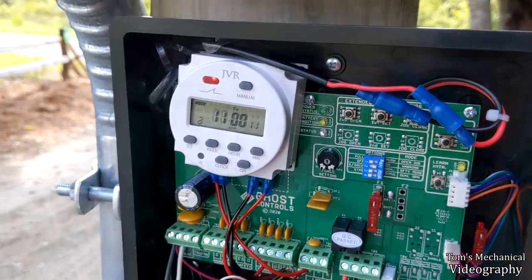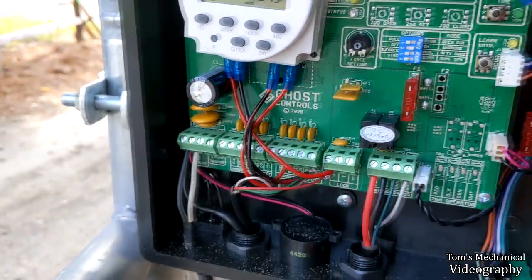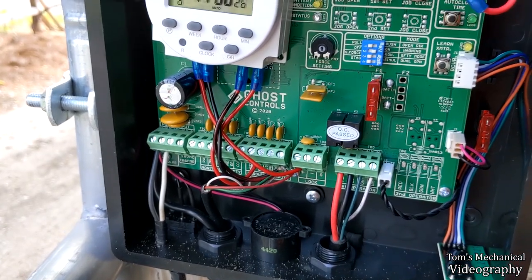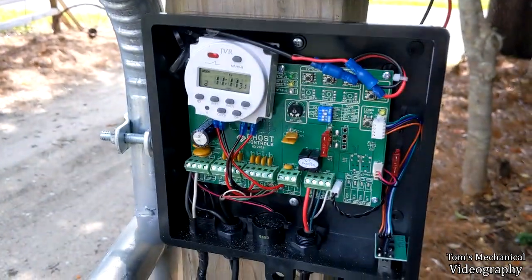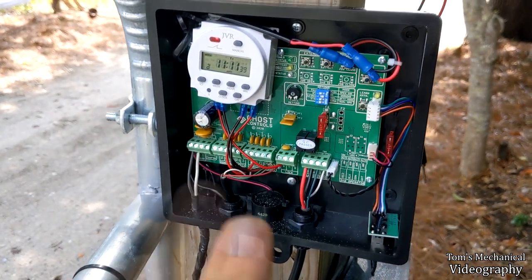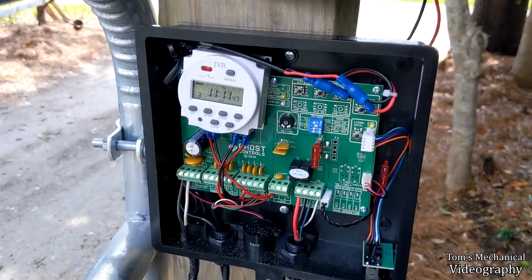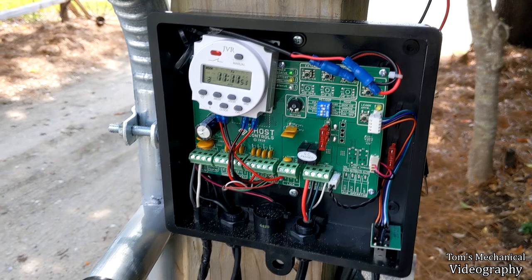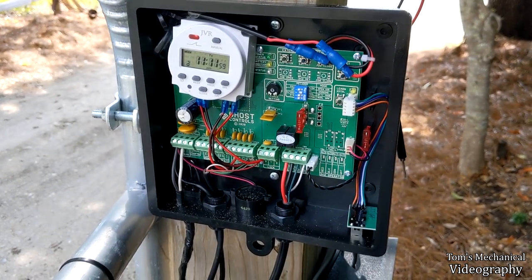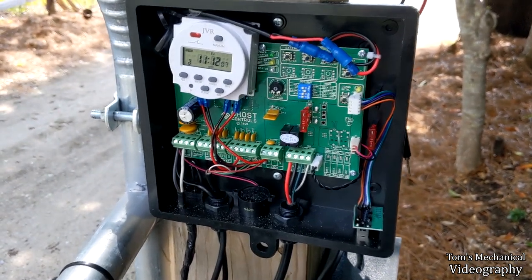I dug out the voltmeter and we're pulling 0.12 amps and 15.5 volts at the panel right now, so only about 1.5 watts at the moment - but the sun is behind a pretty thick cloud. We're losing about 0.1 volt through the Romex so I'd call that good. The solder joints look good. Overall I think this system is working - timer is set for 7 a.m. to 8 p.m. and the solar is handling the charging.